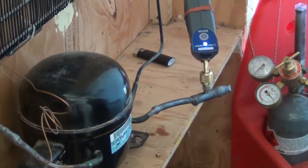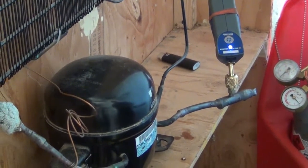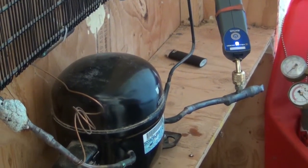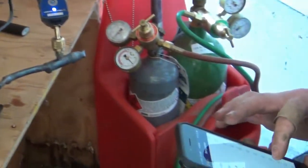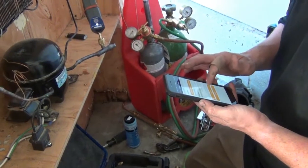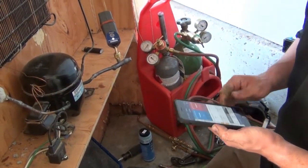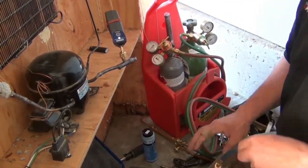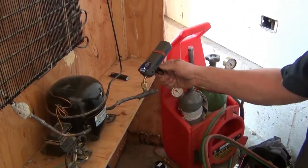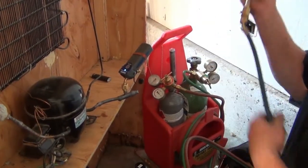Okay, let's connect this guy. Pressure temp session, elevation. This is cool because I can choose 134A — continue — hook to this guy. Done. So we've got three PSI. It's going to fluctuate between the two because there's not really anything in there.